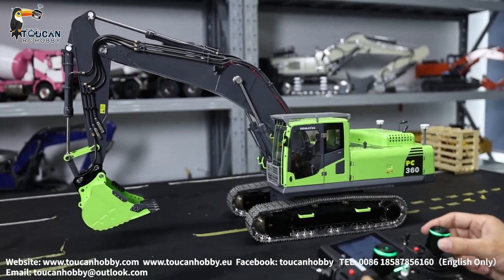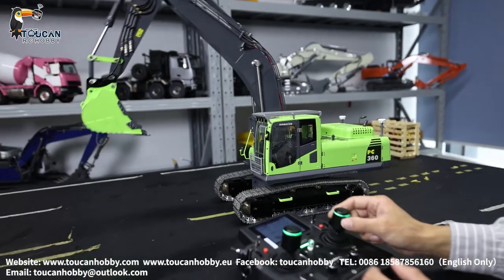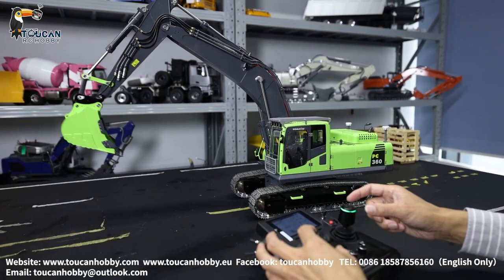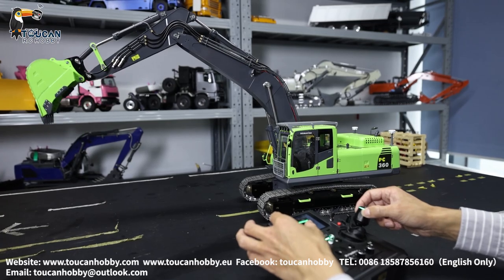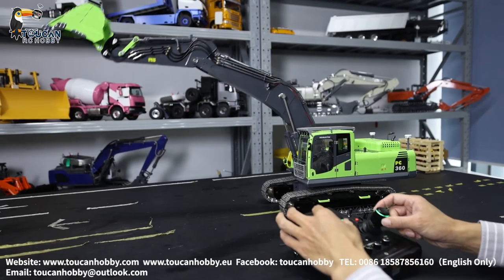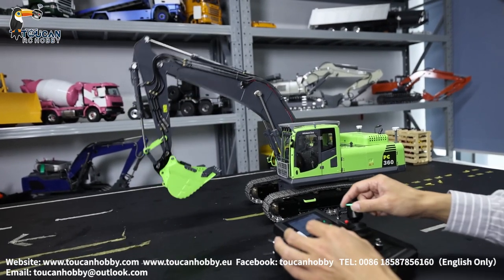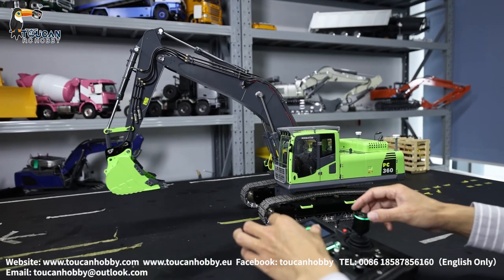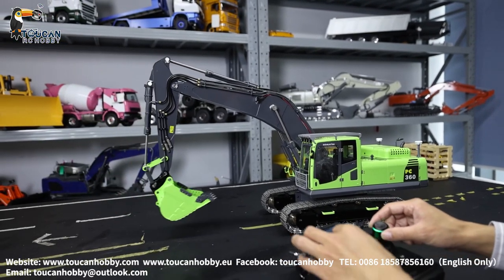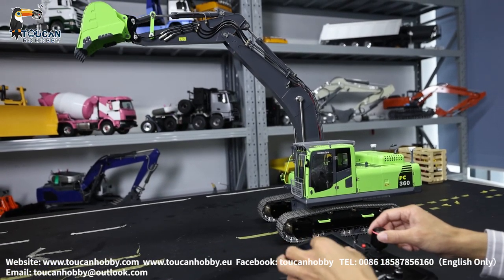So now we will see — start the pump. With only a V-shaped control curve, you will see the big arm is moving very fast, not easy to control. But for the small arm it is a little bit slow — that's the full speed. And also for the bucket, it is slow compared with the big arm. This is why it is moving very fast; if you are fully moving it, it's not easy to control, because the big arm is moving faster than the front arm and the bucket. You see the big arm coming down and up quickly, but the front arm is more slow.